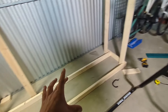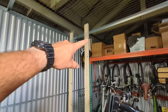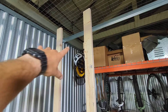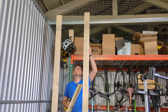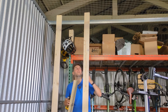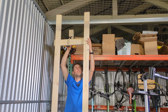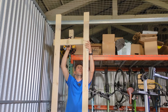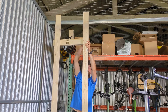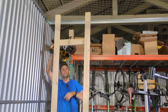So what we've got so far is that frame on the floor with the two-foot 2x4s and the uprights on this side — these uprights are eight feet tall. Now I'm going to attach a cross piece. I've got some guidelines there for where the cross 2x4s are going to screw in. I marked those lines with a square, so in theory it should be pretty level, but with the movement and hand sawing, it's not going to be perfect. It's also pretty hard to hold this — it's kind of heavy — but let's get one in on this side, then the same thing on the other side.